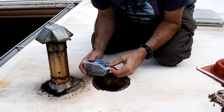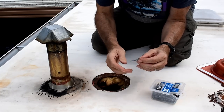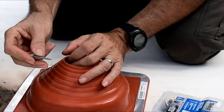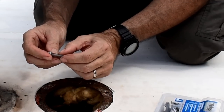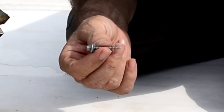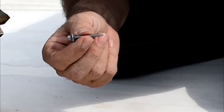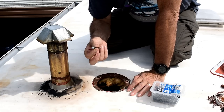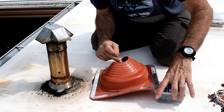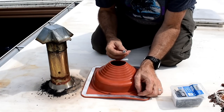The screws I needed are these with a metal washer and rubber gasket underneath to seal when screwing down. I wanted self-tapping sheet metal screws with the rubber gasket, but I couldn't find any less than three inches long — and three-inch self-tapping metal screws would just go through my ceiling. So this is actually a wood screw with a tip on it; I'm going to have to drill holes all the way around to screw these in. That's unfortunate.